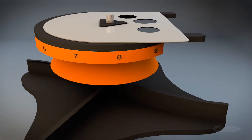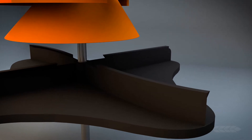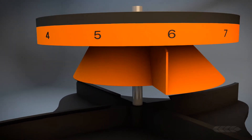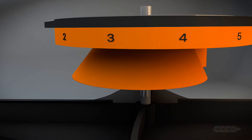As fertilizer passes through the hopper and onto the helical cone located above the impeller, it is evenly spread onto the impeller's surface. Adjusting the spreader's helical cone will adjust the product placement on the impeller, allowing for the fertilizer particle's specific size and density to be accounted for in the spread pattern.